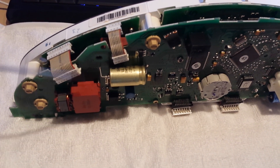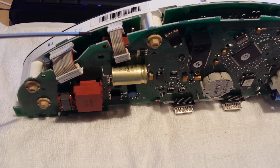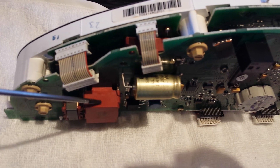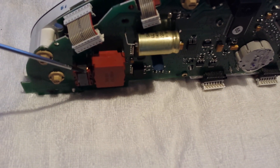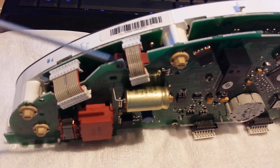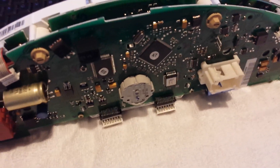The transformer we need to replace is not on this PCB but on the PCB at the back. It's the same color, but four-pin instead of eight-pin. The idea is that it increases the voltage step-by-step — this transformer increases voltage to the next one, and that one increases voltage to the one at the back. I believe it goes all the way up to something like 20,000 volts to power the fluorescent tubes and fire the gases inside.